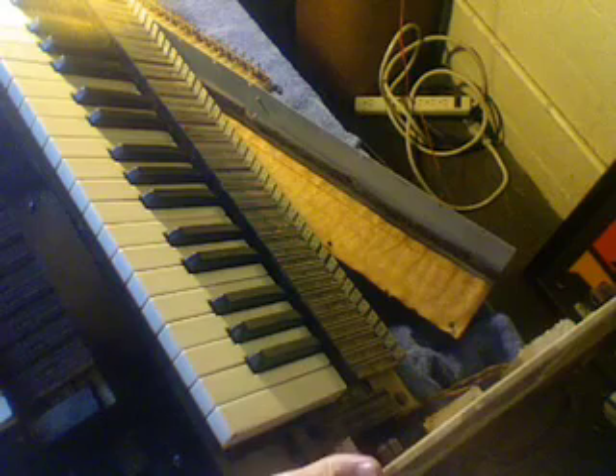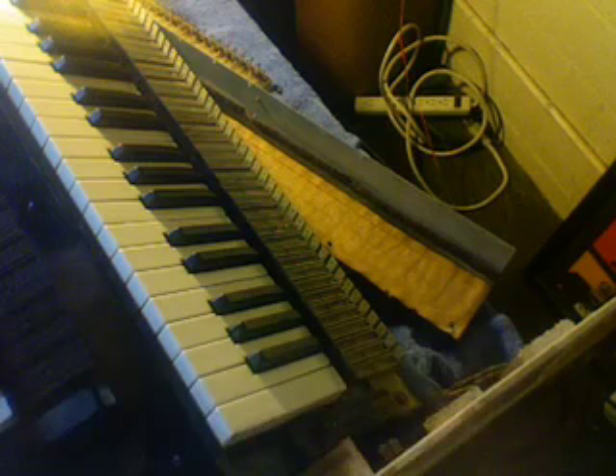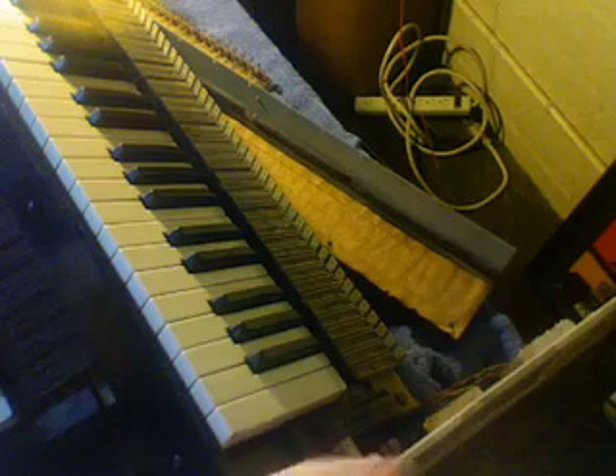This job requires a little bit of prep work. As you can see, in a previous project I removed the lid — some gentle to not-so-gentle whacking with a rubber mallet on the underside will get that out. Sometimes it chips the veneer, but this is going to be refinished anyway, so just a little sanding gets it in place. Sand down these joints so they don't fit quite so snugly but are still there for support. I've also added cabinet locks in two places so the lid snaps on and can pull off for ease of use.